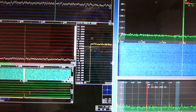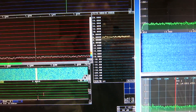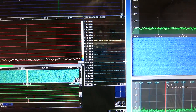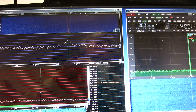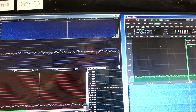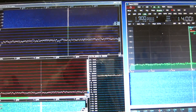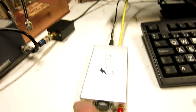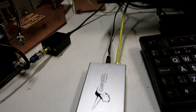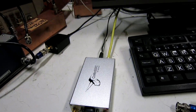That's quite a lot. I have made tests on this Colibri before with surprisingly poor outcome, and this is part of the explanation. A proper solution would be to solder something inside, not to just trust copper laying on metal surfaces. I don't know if it may oxidize or how reliable the connection is, and particularly squeezing the copper between the front panel and the box is not a reliable way of grounding to the metal of the input connector, which is probably the proper place.